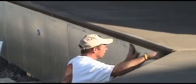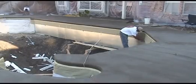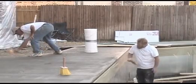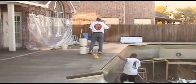Masking the pool panels and steps saves cleanup at the end of the job. When dashing the inside and outside edges of the deck, it is always best to dash these edges and finish dashing the top of the deck bay by bay. This avoids any chance of overspray.